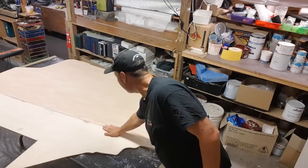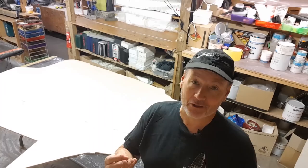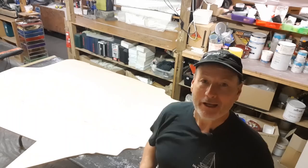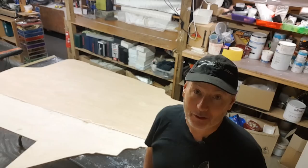That's all sanded neatly now — basically down level. There are a couple of low spots which I'll fill with fumed silica and filler. Then I'm basically going to wet it out and leave it overnight to ensure a good bond between the plywood and the resin. I'm going to come back in tomorrow, like I've done with all the other bulkheads, and laminate that 600 double bias onto it.